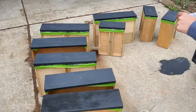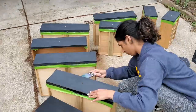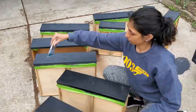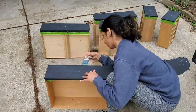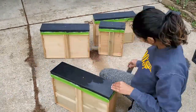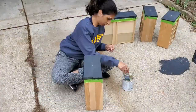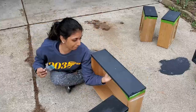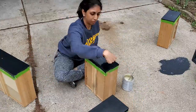I finished this all off with a lacquer top coat. Something that I didn't film but really lended itself to that mid-century modern glam style I was going for is that at the bottom of the legs of the dresser, I actually painted it gold. I just used some frog tape to mark off where I wanted and then spray painted the bottoms with a satin bronze gold — it almost gives the illusion that the bottoms of the legs have a gold metal finish, but it's just paint.